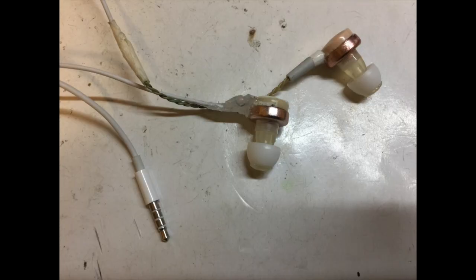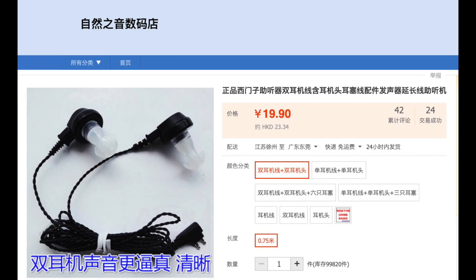This is the headphone I am using — actually a pair of earbuds called REET earbuds, because they are different from conventional hi-fi earbuds or headphones. The coils are wound differently — higher impedance and more sensitive. This pair has a total impedance of 600 ohms — 300 plus 300. You can hear very weak radio signals through them. If you can't get hold of those, you can try earbuds for hearing aids, which also have a high impedance around 150 ohms each, making 300 ohms as a pair. Sensitivity is okay — not as good, but still usable for crystal radio.